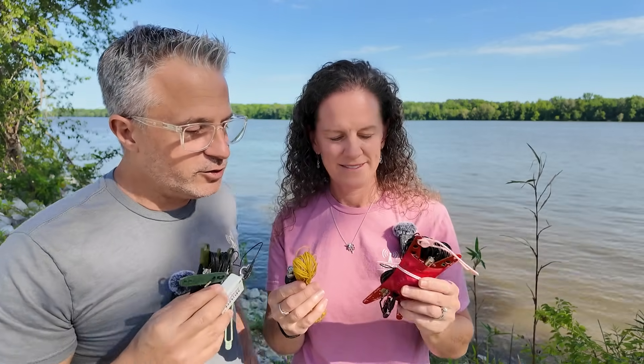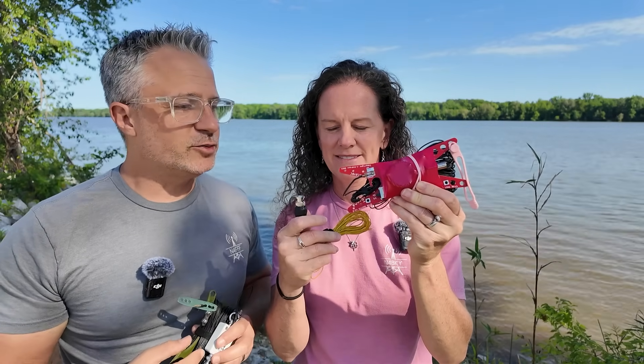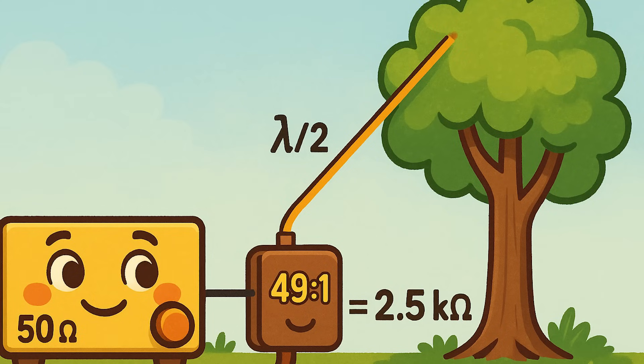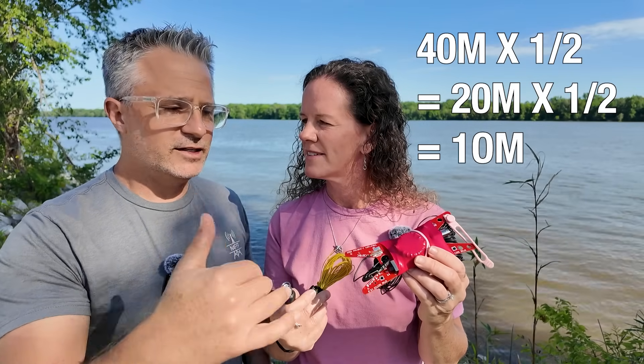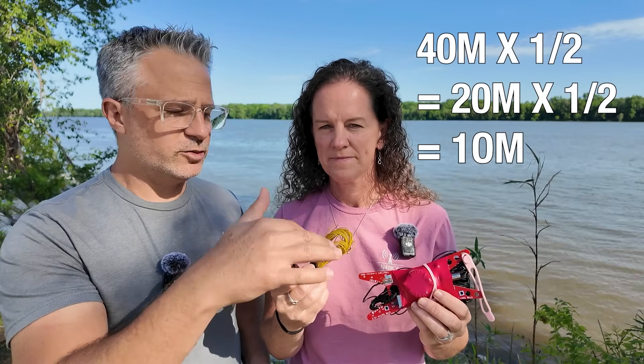The next type of antenna we're going to talk about is our new favorite — the end-fed half wave. For a long time we didn't use these because we were striving for efficient antennas that don't require a tuner. Even though these don't require a tuner, they do require a matching transformer built into each one — I just didn't realize that at the beginning. These are a half of a wavelength — hence the end-fed half wave. The end-fed part means you're feeding it and connecting at the end of it, which is why you need that transformer. These also work on multiple bands because they're a half wave — so if you cut one for 40 meters, it also works on 20 meters and 10 meters as harmonics.